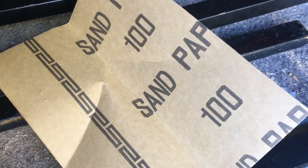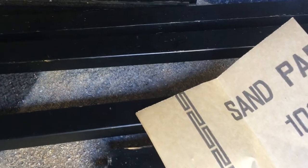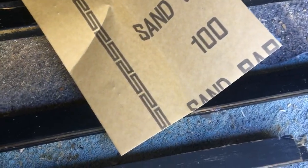I've got all my pieces off. Now I'm going to sand them and then spray paint them all black. I'm just sanding them down with 100-grit sandpaper, and I'm only sanding the side that is going to be facing outward because the other one is going to be attached behind so you won't be able to see it. Please wear a mask when you're sanding.